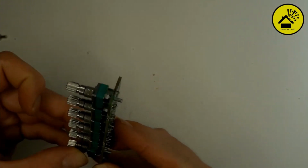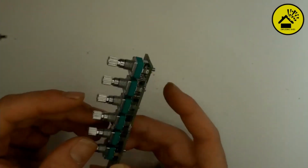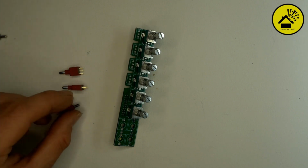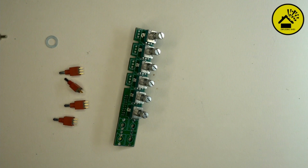Because if you have to change this afterwards, it's possible. And in case of potentiometers, it's still quite easy because you only have 3 or 5 contacts if you count the solder lugs on the right and left side. But if you have to take off the big headers and this kind of stuff, that's really hell if you have no hot air.